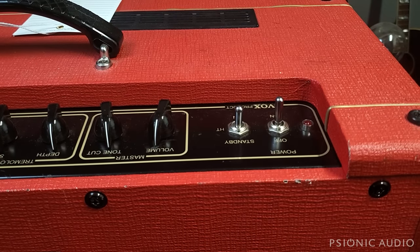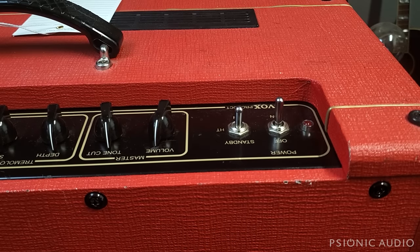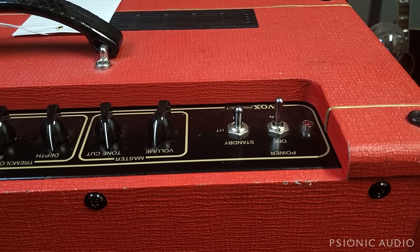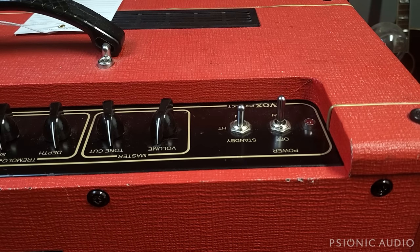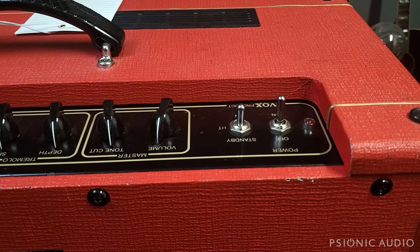Side note, if you have an amp with cathode follower, such as this, or a Marshall Super Lead, or a Tweed Bassman, avoid Russian preamp tubes for the cathode follower stage. In this amp, it's V2. For some reason, the high voltage on the cathode in a cathode follower stage makes all current production Russian tubes very unhappy. Go with the Slovakian JJ, go with various good choices of Chinese-made tube, or seek out a new old stock just for longevity. But that is an issue that you should be aware of.